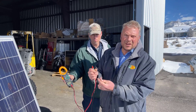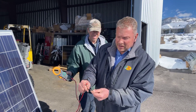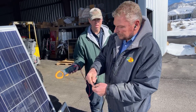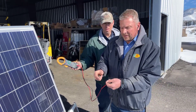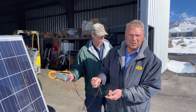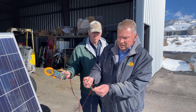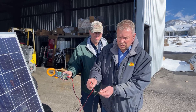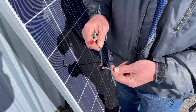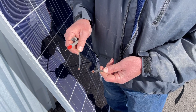You can't really feel anything at 35 volts. Now this is the first thing I ask people to do when they say they're getting voltage from their solar panels - say 37 volts - but it's not charging. I ask them to touch the wires together. If there's a big spark you know there's power. I'm going to shade this panel to show you - if there's a little spark like that, nothing, then no wonder you're getting no power through your inverter. Now you need to figure out if it's a bad connection or a bad solar panel.